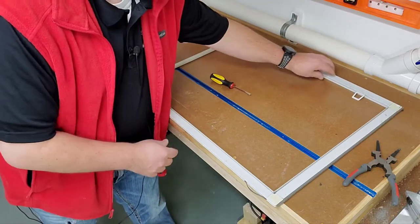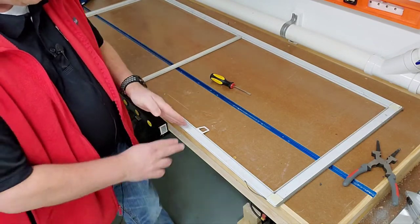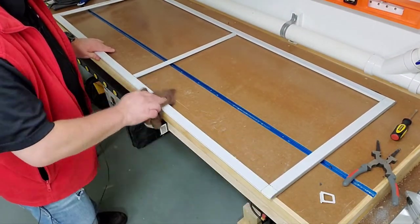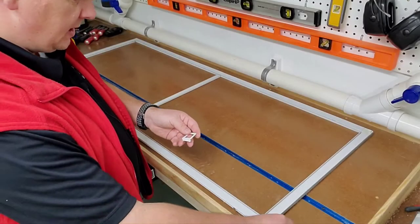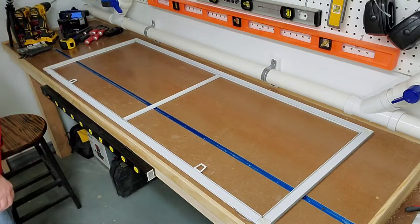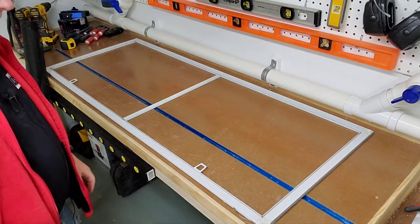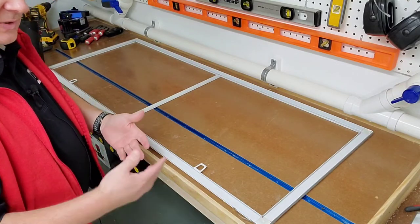One note here — you'll see that we have those tabs I was previously talking about. These can be picked up at hardware stores. They just lie right in here and when you install the screen and spline it holds that in place so you can hold your screen when installing. Now is an excellent opportunity to take some soapy water and a washcloth and clean off your frame for the new material to be installed. Let's set our tabs in the locations that we want. Before we lay the screen down, let's talk about spline material. They make a lot of different sizes and how you choose that size is to measure the channel that it lies into. Mine is one-eighth inch, so I picked up some one-eighth inch spline material.